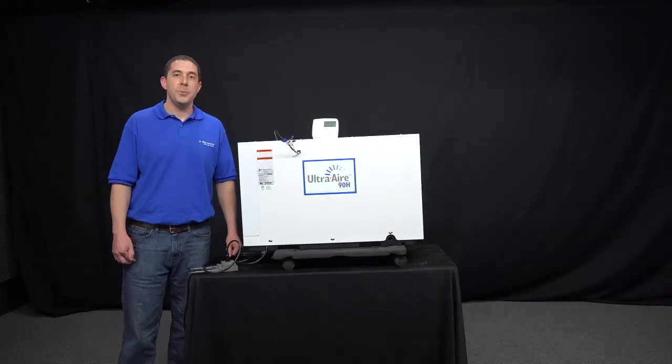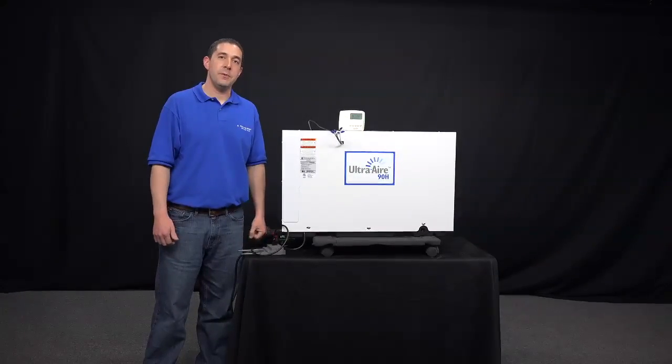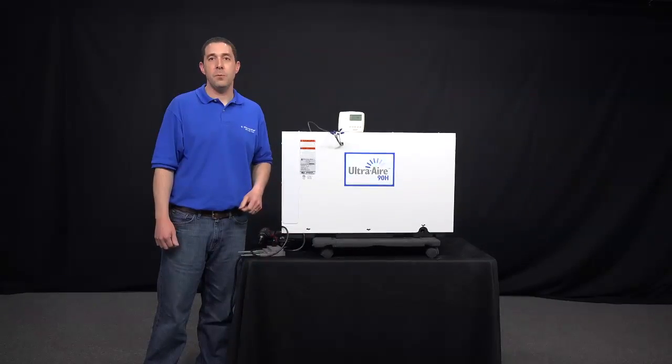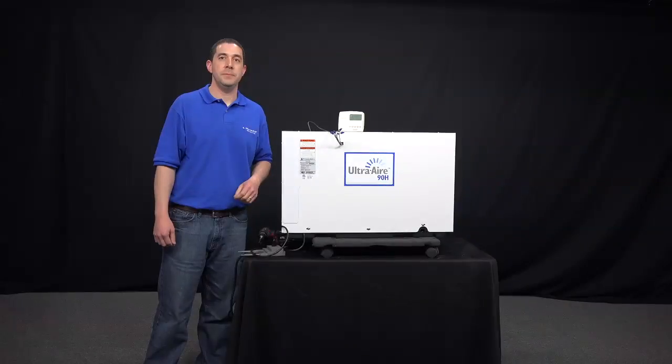In this video, I will be showing you how to diagnose and replace a fan relay on a Ultra-Aire 90H dehumidifier. The two symptoms of a faulty fan relay are the fan does not run no matter where the control is set to, or the fan runs continuously whether the control is in the on or off position.